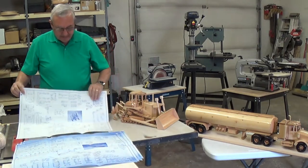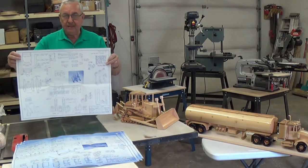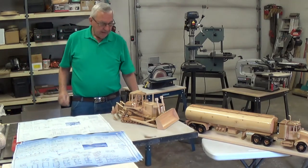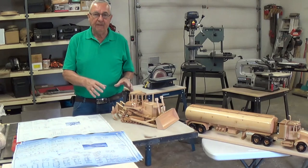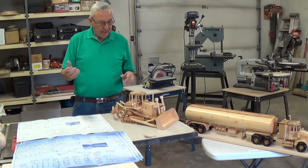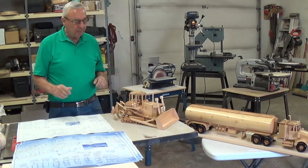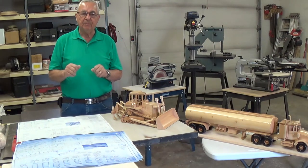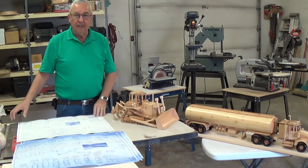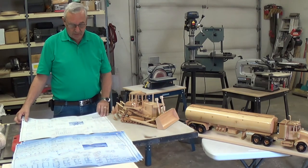On the back end there is a full sheet of just the ripper. If you look at this ripper, there are a lot of pieces that go on there. One thing I can't emphasize enough — because of the little pieces when you're working with this type of stuff — always practice good safety. A router bit has no sympathy for a finger, no respect whatsoever. You can lose the end of a finger so fast with little pieces. Always make sure you've got a jig so you're in control when working with power equipment — the end result will be better and the environment safer.